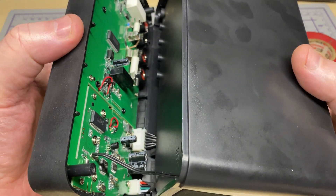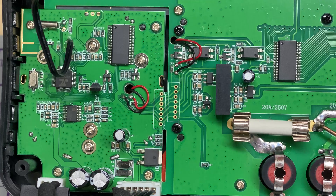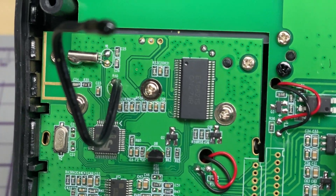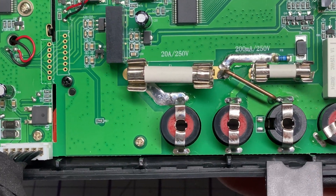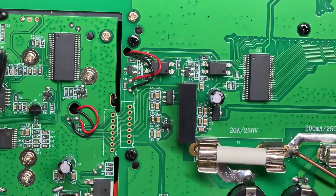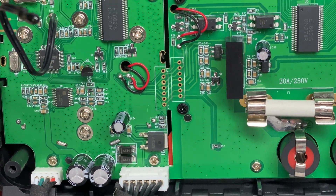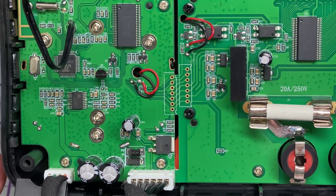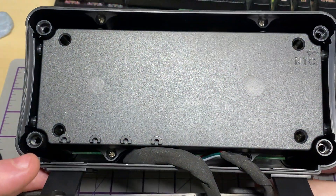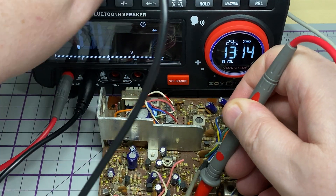Let's have a quick look inside. All the magic seems to be happening behind the front panel. We've got a temperature sensor, and that gold squiggle in the corner must be the Bluetooth antenna. There are a couple of meaty ceramic fuses, a couple of relays, a buzzer, and some optocouplers by the looks of it. You can see some regulators — it's very nicely put together. In the back there must be the housing for the speakers, and behind that we'd have the battery compartment and the board for the rear buttons.